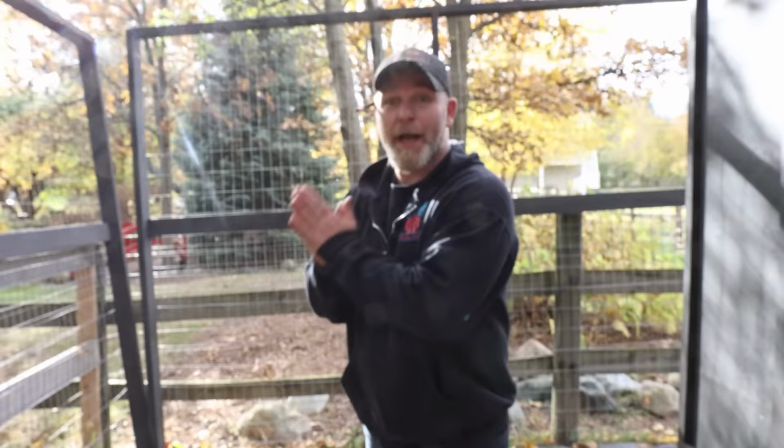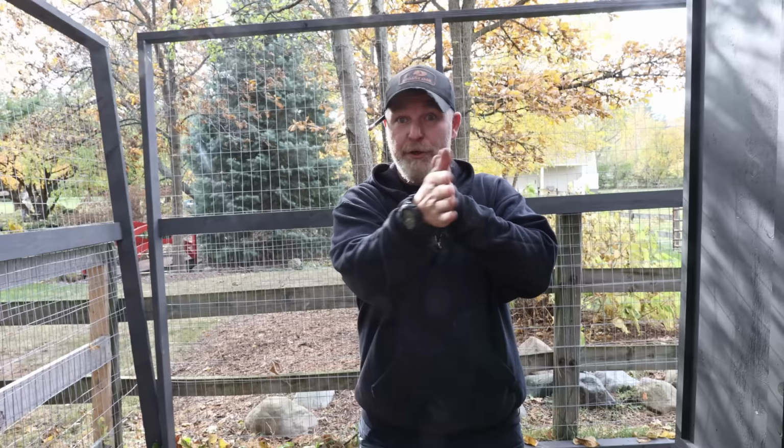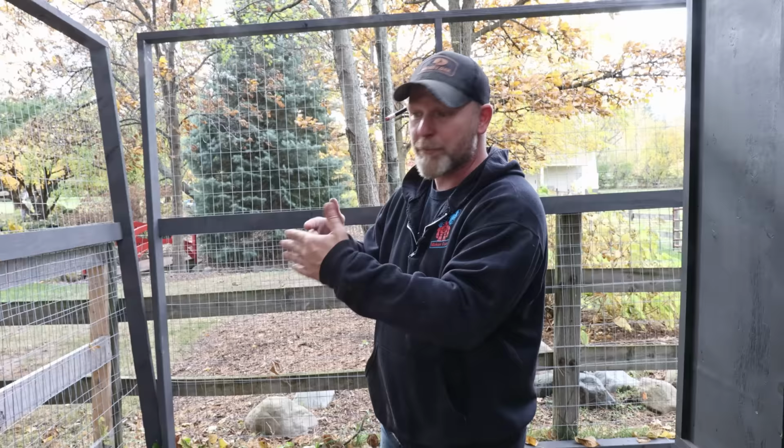So I have my first two walls set up, and they're gonna be the first 90 degree corner, because if I were to put two walls together like so, it would do, you know, funky wonky things, and we don't want that. So once we have our 90 degree corner established, screwed together, we can then work all the long walls off, and it should be a fairly simple process. I always say that, and you know, never turns out that way.